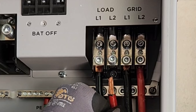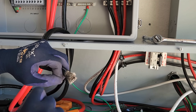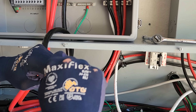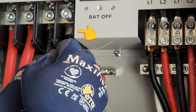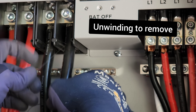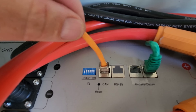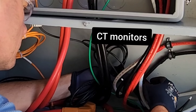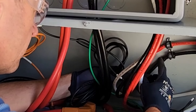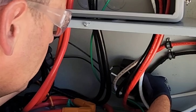Let's go ahead and hook up the battery cables — two positives, two negatives. I need to get some ferrules for these; they said it's not required but it'd be nice to hold everything in place. People use a zip tie to hold these down but I could never get that to work properly. Okay, that's the right direction — this is for L1, and this one's for L2. These will help me measure my interaction with the grid.